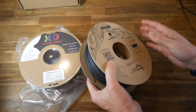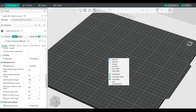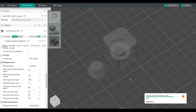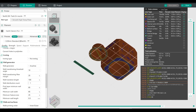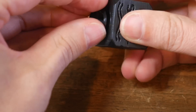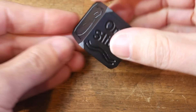This spool appears mostly like a matte PLA. I'm comparing PHA to PLA because that's the filament I think it would replace. My first question was: how many settings do I need to change to print it? We start with a baseline PLA print on my second SK tank using the built-in Orca Slicer Orca Cube — an excellent test object with fine details, overhangs, and we can test how the two halves fit together. With a well-established PLA profile, it completed successfully on the first go — a perfectly respectable print. The two halves screw together, clearances are spot on, though I probably need to up my flow rate just a little bit.